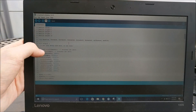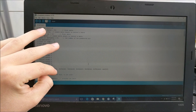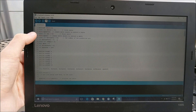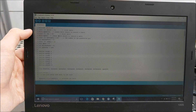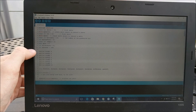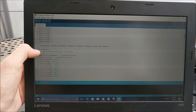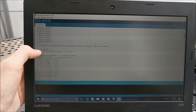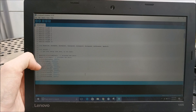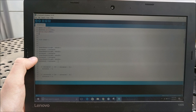This is the code that I used for the whole Arduino, and I'll put a link to my instructable in the description that will have this code inside — that instructable will be up in the next few days. How this code works is in the top it initializes all the pins to do the different things that they do, including the Bluetooth module. These are all the trigger and echo pins for all the ultrasonic sensors, and these are some long variables which are 32-bit that store the distances. Right here is where it scans all the sensors — it runs a method called sonar sensor which pings each one and receives the echo for the distance.